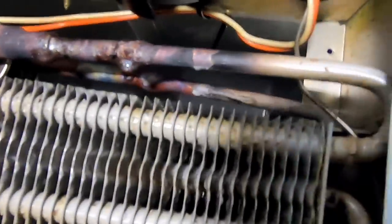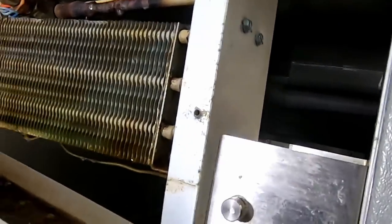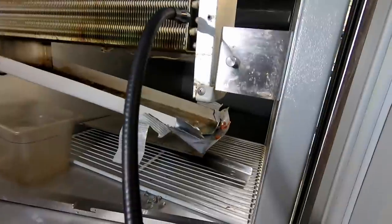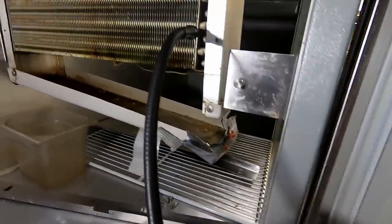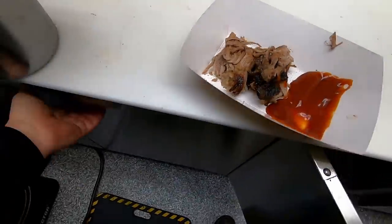Got that done. We're going to spray this once we get it pumped up with some nitrogen. This coil really should probably be replaced, but unfortunately when you've got that much leaking going on it's hard to narrow it down. We're going to pump up some nitrogen and see if we got any leaks - may even get the ultrasonic out, probably will use the ultrasonic. Only place I'm hearing a leak is right down there. Up here we're good to go. We fixed three leaks total but I can hear something down in that area. We'll spray it right here - chances are the coil needs replaced, and if we do that we'd probably do a new TXV at the same time.